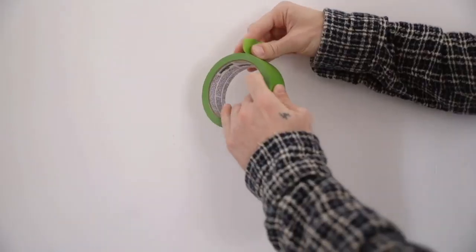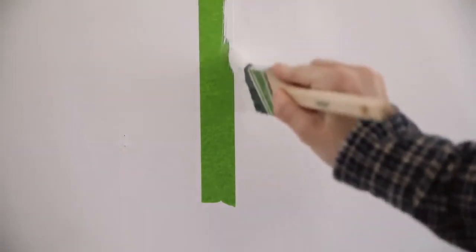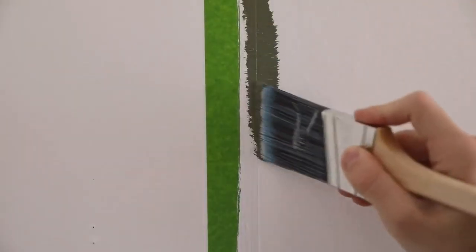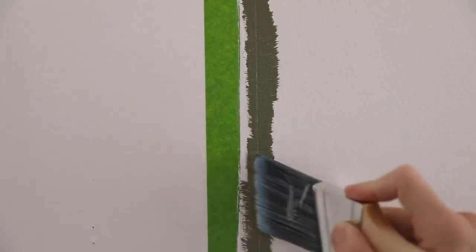I've mentioned this painting tip in multiple makeover videos but never in a tip-driven video. It's an incredible tip for getting a clean line once you remove your tape — because tape is very deceiving; even if you apply it perfectly, it always bleeds. A great way to prevent bleeding: put your tape down, then go in with the original wall color that's already on the wall and paint that onto the area you're going to paint your new color. Anything that bleeds will be the wall color, so it's virtually invisible. Once that dries, go in and apply your new color. The demo shows how clean the line on the right is compared to the left where I just taped normally. Just apply the first color, then your second color, remove and you're golden.